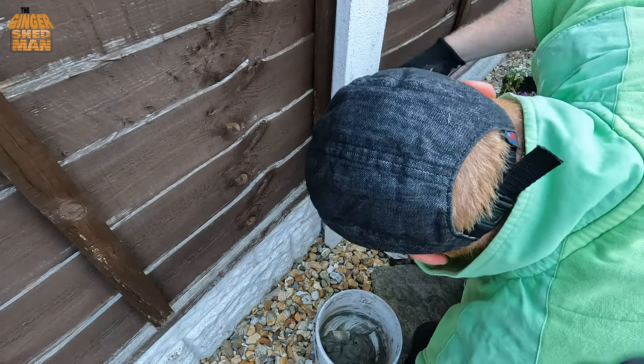We have to excuse the shadow because the sun is directly behind me. We're now drying off — solid. It's been a couple of hours since I put all that on, so it's time to sand and shape. I don't think it's 100% set so I'm going to shape it with some sandpaper — probably better than using the tile file and rasp I normally use, as that would take too much off. I'm using a Stanley sanding block because it keeps things relatively flat and gives you something to work with against the shape of the original post.